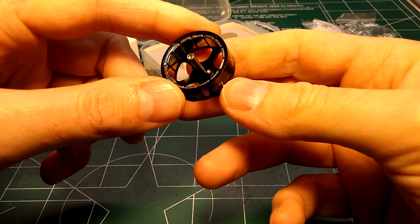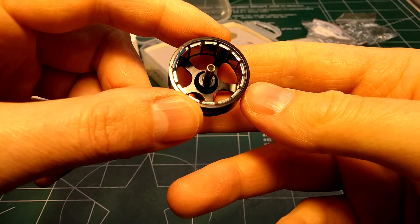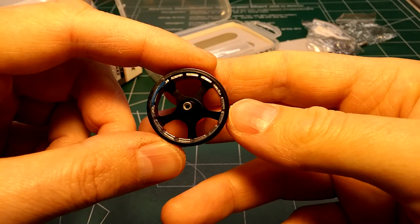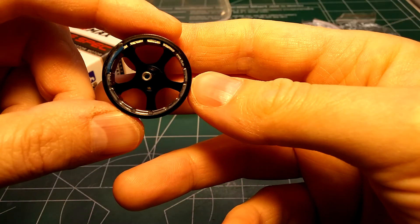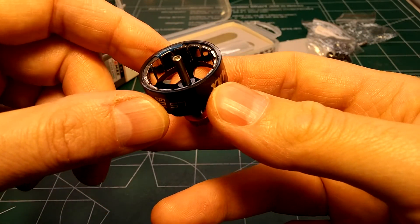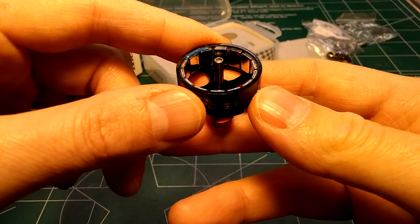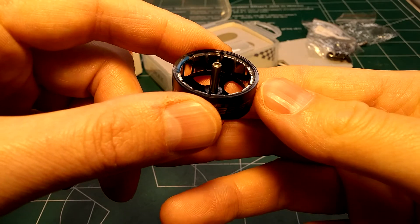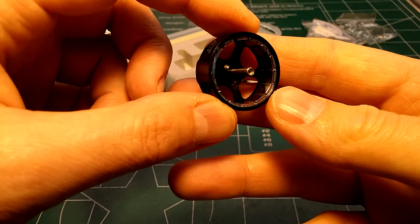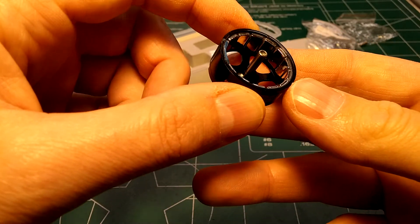Taking a look at the bell first — you can see the balancing mud, so they've dynamically balanced it really well. The magnets look to be curved. Beautiful magnets, nicely spaced, with some balancing mud. The 1.8 millimeter magnets look great, and there you can see the hardened steel shaft.